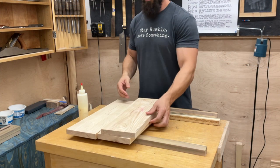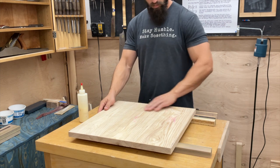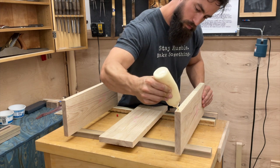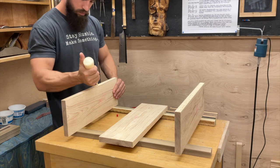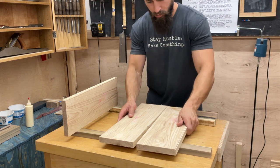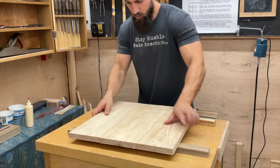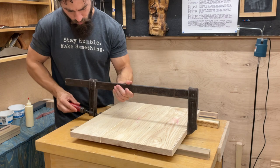The first thing we're going to do is a panel glue-up for our top. No matter how large or small your tabletop is, pay attention to grain orientation, because this is what folks are going to see. This tabletop is 18 by 18 inches. I've split it into three six-inch wide boards for some uniformity — without doing a book match or a single slab, which is what I do in the more advanced table. This is excellent practice for larger dining table panel glue-ups.